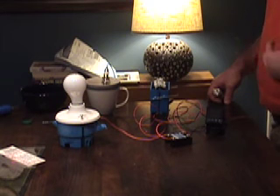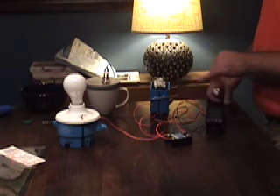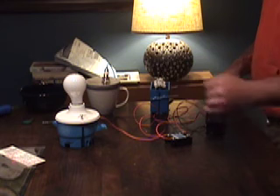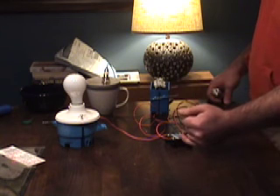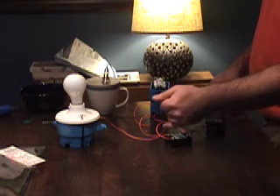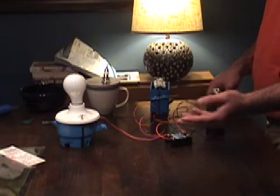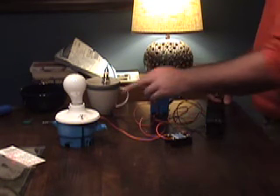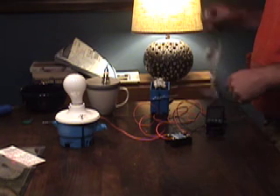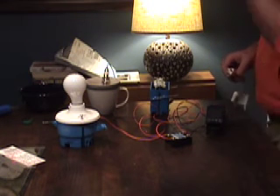This really helped my confidence knowing that I understand the flow of things. I have two leads coming off here: one to power the PID unit, and the lead coming off here going to terminal one on my solid state relay, with a lead coming off that going to my light. So when that is turned on, it completes the circuit and allows the flow of electricity into my light. My neutral line here is tied in with the neutral line from here and also tied in with the neutral line of the PID.